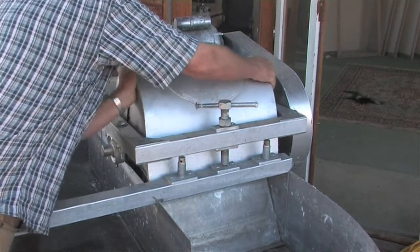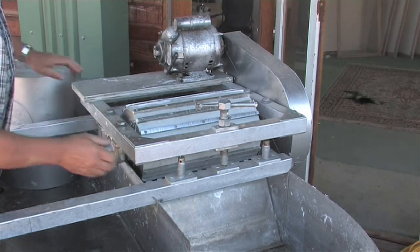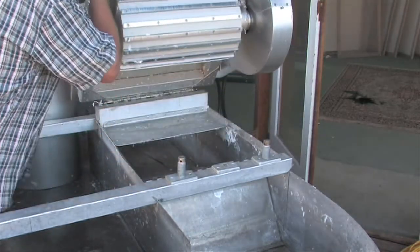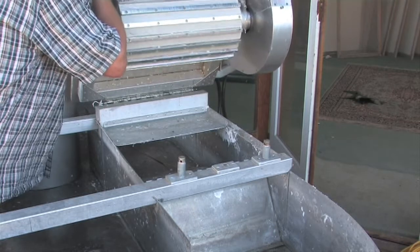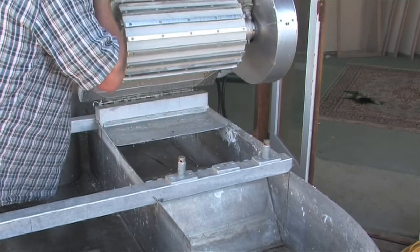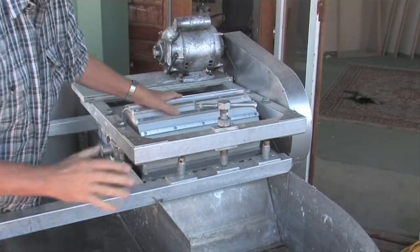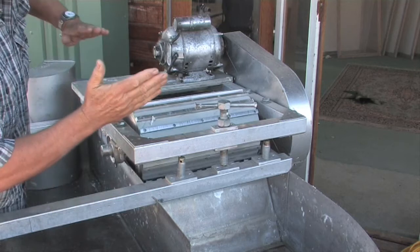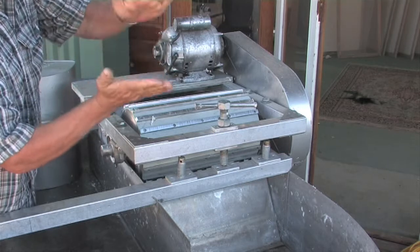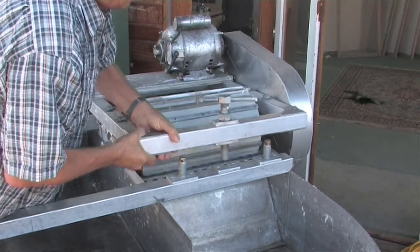Under here, this is the beater roll. So you can see it's a large spinning drum with bars on it, and it spins over a bed plate. And as the pulp rolls through here, it gets a good beating. So there's a hammering, there's rubbing, and there's also pounding as it jumps over the lumps and bumps. So it's on a hinge, so that can go up and down.